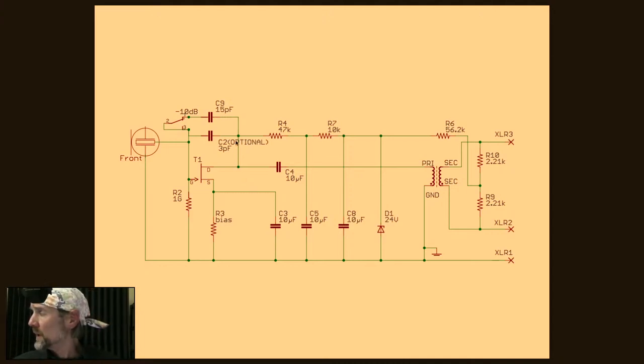And so there's an optional capacitor you could install here that would take that audio signal right off of the JFET. Now, this is going right out the back of the microphone, right? This is your output audio signal right here along this rail. So you could take that and go through this little capacitor and feed it back into the input. That's why it's called a feedback cap. Now, because this is reversed in polarity with respect to this, what happens is cancellation, all right? So the audio signal here is coming through at a lower level, and the amount that gets through is set by the size of this capacitor. I don't mean the physical size, I mean the value.